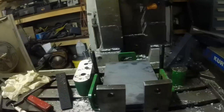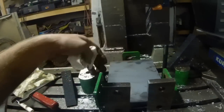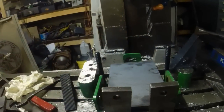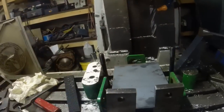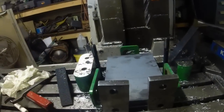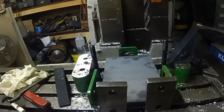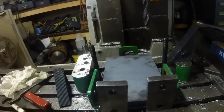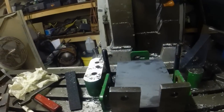When you're doing setups you can just quickly stick these in, put your parts up against them, and you'll know that you're parallel with your mill table. For a lot of work it's a really fast way to do something like this where it's repetitive.